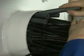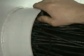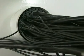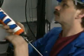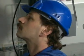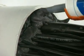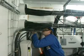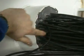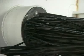Once the cables have been pushed into the pipe, spare sleeves are inserted to fill up the remaining spaces. Sealant is applied in the usual way, starting at the centre in the most difficult section of the conduit, working outwards towards the sides, once again ensuring that no gaps exist between the cables. The installer checks thoroughly that enough sealant has been applied before pushing it into place, taking care to press between the cables and then smoothing off by hand. One last check ensures that the cable penetration is completely sealed.